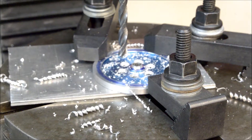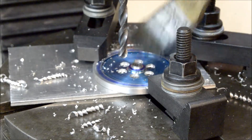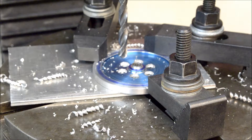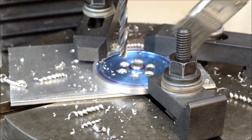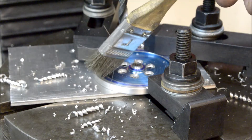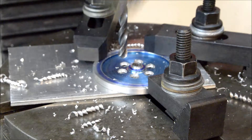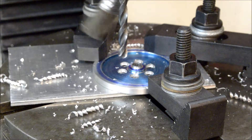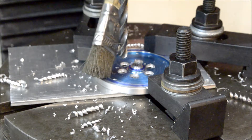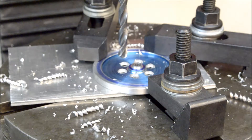I'm going to pull the chips out. So — six evenly spaced holes done. Now I've got to move it out to seven-eighths of an inch and drill a series of eighth-inch holes. This time I'll be drilling 12 of them, and those will be the outer edges of the spokes. I'll bring you back when I have that set up.